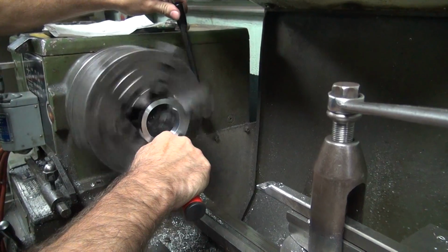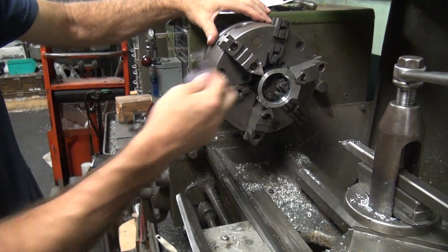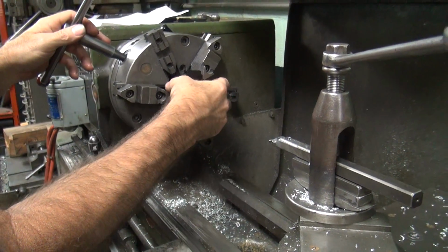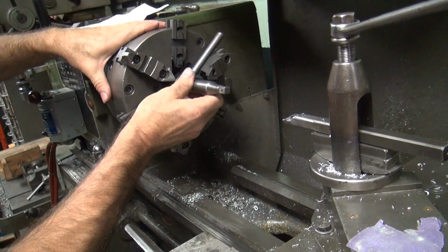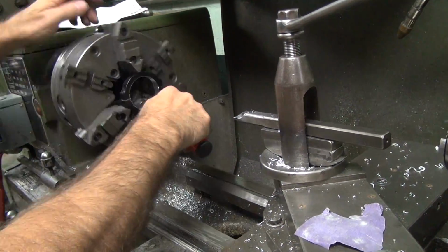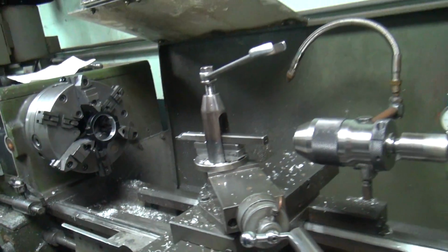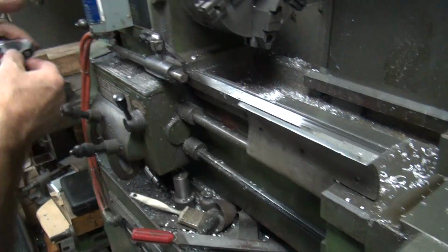Our deburring tool works a lot better now. I don't have to cut over spots I had before. Right. And I got some nice 180 grit paper here to smooth up the hard spots if that cutter's leaving. There's a nice smooth surface. Take it around, flip it. I'm only sanding the radius. I just want a small edge added in there. See how the edge is going. So you take it out, go blow the crap off, and see what condition it is.